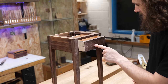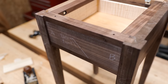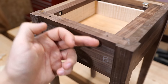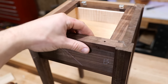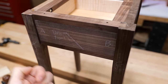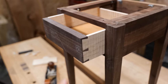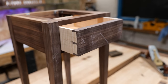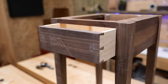There's a tiny grab there but by the time we sand down these sides that should be fine - it goes in just fine without me holding the table, but as soon as it gets there it starts dragging the table with it; we get past it and then we can push it again. At this point we can assess how the drawer front is sitting and figure out if we need to take more off either side to get it flush. If it were sticking out more on one side you could score a knife line along the top and bottom and plane back to that - you'll end up with a smaller lap on one side but with drawers you can't look at both laps at the same time so it won't be too noticeable.